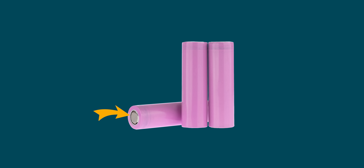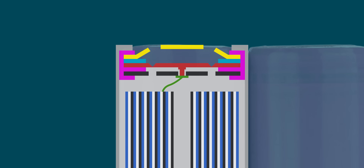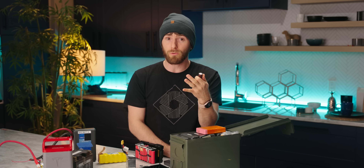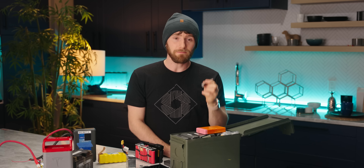They aren't the only safety, though. The second safety is built right into the cell itself in the form of a pressure relief vent on the positive terminal. It's designed to vent waste gas generated by internal short circuits that naturally occur as the cell ages, preventing the cell from pressurizing and creating an explosion hazard. You've probably experienced cell bulging before with an old laptop or phone. It's a similar idea, except 18650s have a rigid outer housing which won't just puff up.